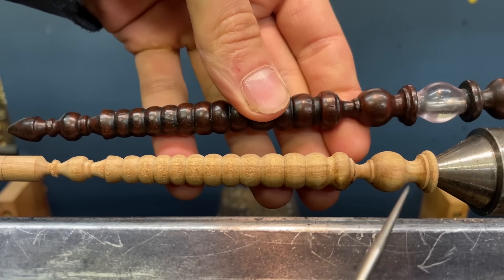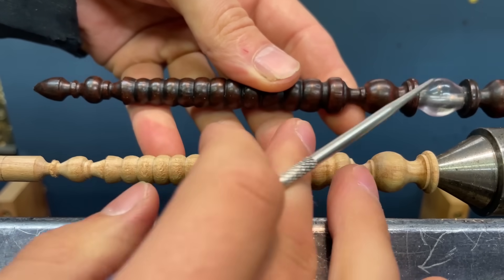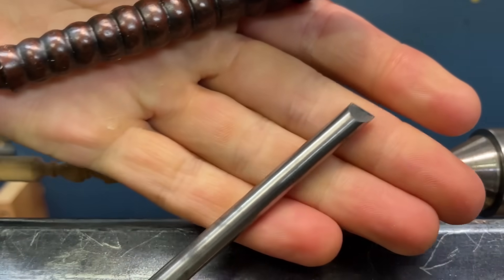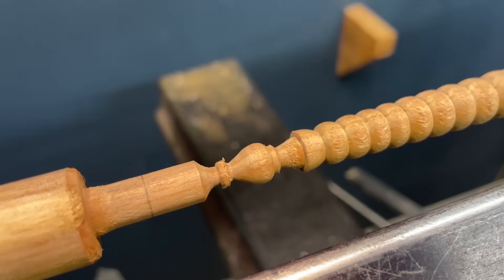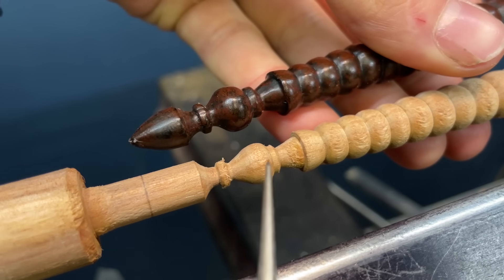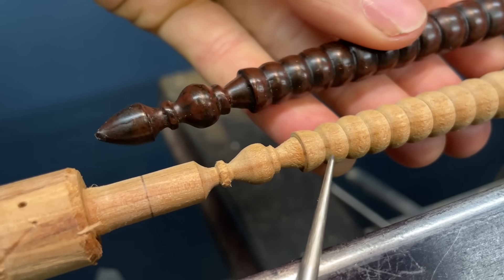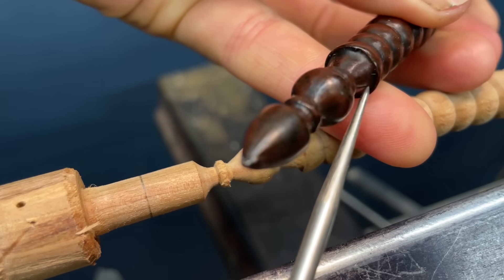Right, that's the first stage of turning down, and I have to apologise because this wood is a bit too rotten — it was the only silver birch I could find. It's also slightly damp still, which makes it easy to cut but means you get a bit more tear out — you can see down here it's gone a bit wavy. This is why it's so important to have sharp tools and use the correct tools — none of this carbide nonsense, which is the devil's work. I've really struggled with getting the tool in here; I'll try and gently sand this out. You can see just how much tear there is, and look how much twist there is that's sort of going to come off soon.